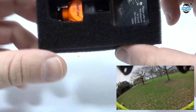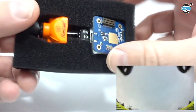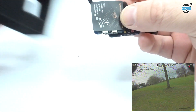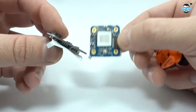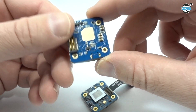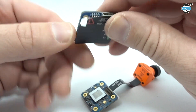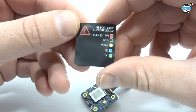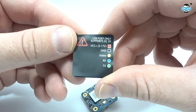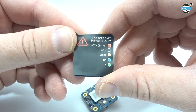The camera lens has a smaller field of view — the HD field of view is at 165 degrees while the FPV field of view is 130 degrees. This board is measured out in a 20 by 20 size, so it's going to fit you smaller flight controller guys with the Pico F4s and so on.